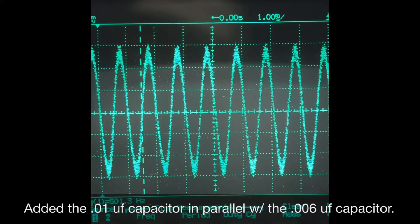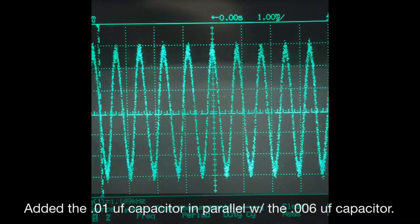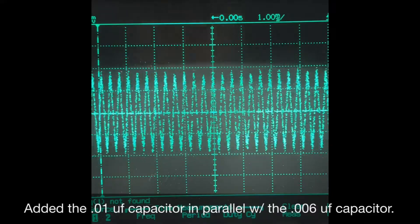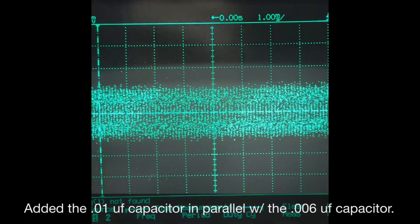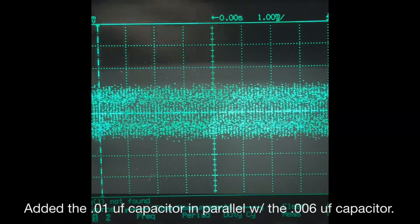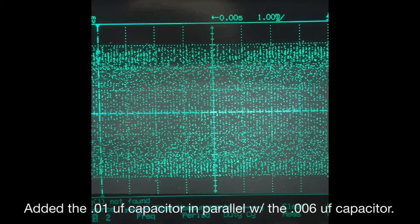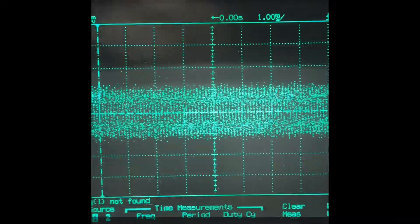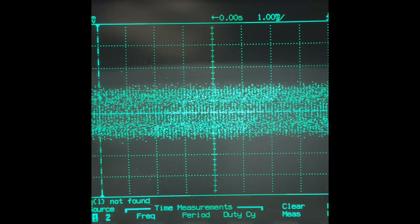Now watch what happens when I rock this up to about 5,000 Hz. That's a great demonstration of the difference in power and the impact of the capacitor on those higher frequencies. I'll pull the cap off for a moment and you can see the change — where I took the voltage measurements in millivolts and converted that into decibels so we can understand the losses.